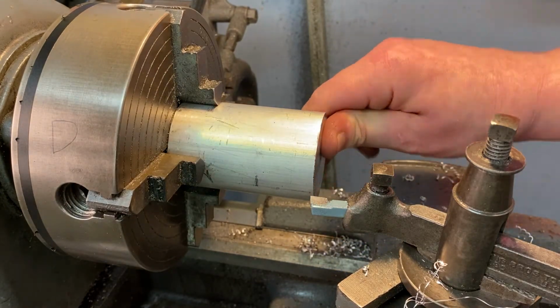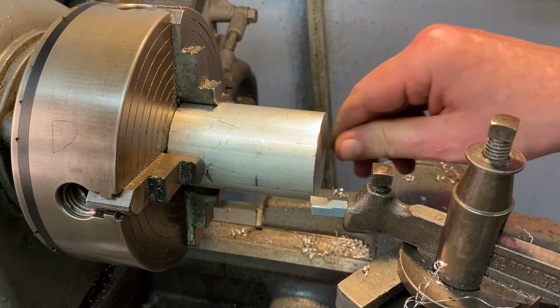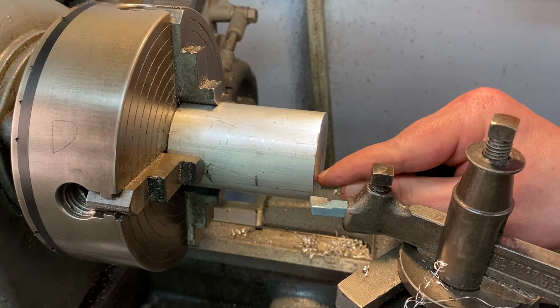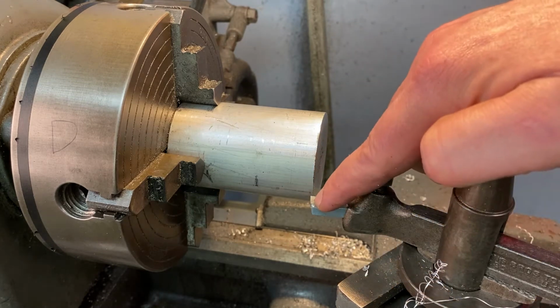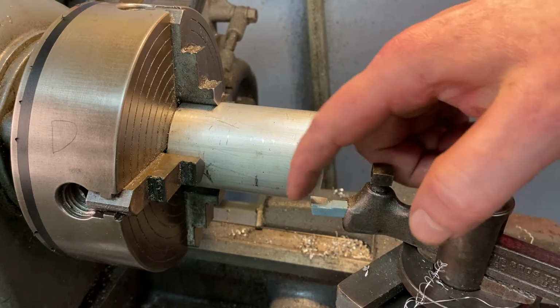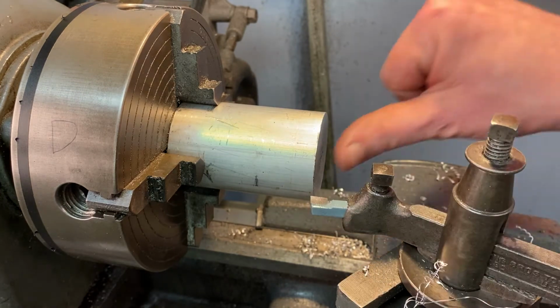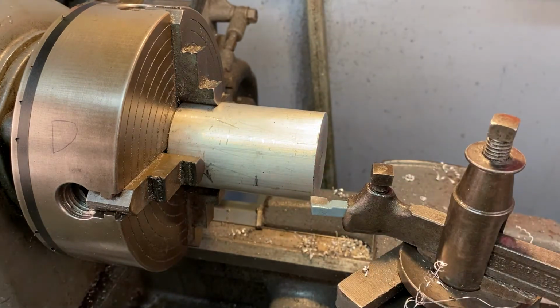It's okay. It feels pretty good. It's smooth, but I can feel a little bit towards the center. As it got kind of quiet there, it actually created some grooves. So I could actually change this angle a little bit and decrease the gap between the back edge of our tooling and the front edge of our piece.